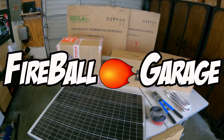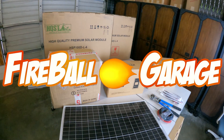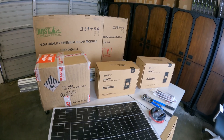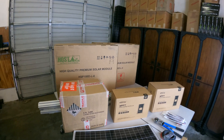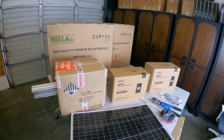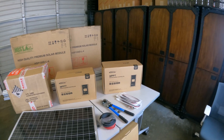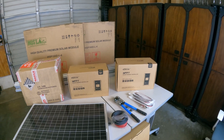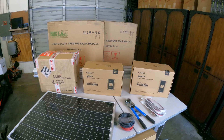We decided to upgrade our solar system. We had quite a few troubles in Colorado. First of all, I don't think the sun was as high in the sky — when I was doing the testing we were in California. We found out that our property in Colorado is at 8,100 feet elevation, so the sun was more on a horizon arc and the panels kept blowing over. Also, the charge controllers that came with those portable solar panels were PWM controllers — pulse width modulated — which is less efficient and cannot optimize for voltage differences.